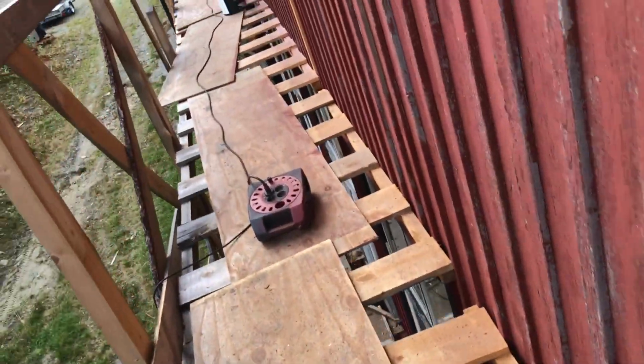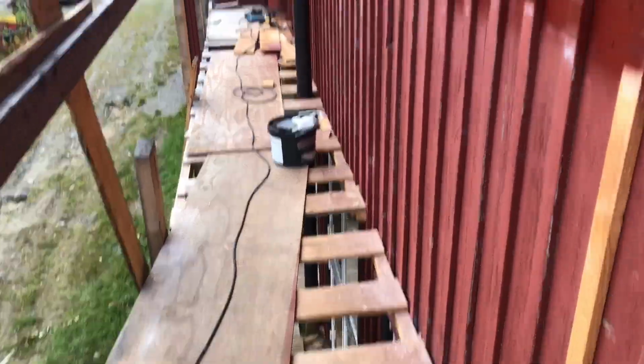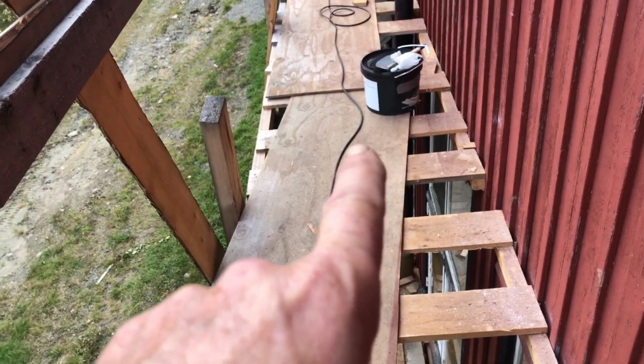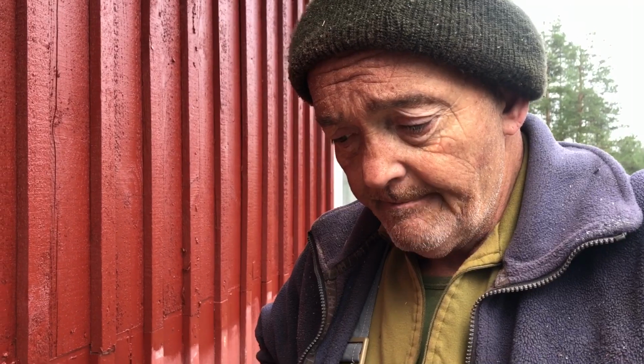All I have by way of paint is what was left out of that tub from doing this section on the base coat. The other tub is currently in transit, so I'm going to start by brushing it because there's no point in setting up the spray. Setting up the spray doesn't take long, 30 minutes, but the breakdown takes a long time because of the cleaning. So I'm just going to start with a brush just in case that other tub doesn't arrive in time for today. I've got to stop at some point because of the low temperatures overnight, so we'll get on now.